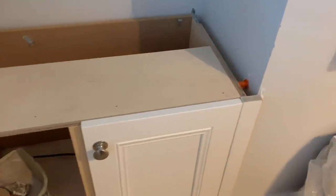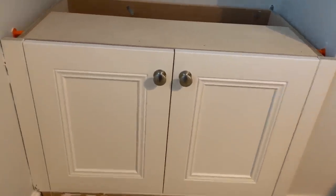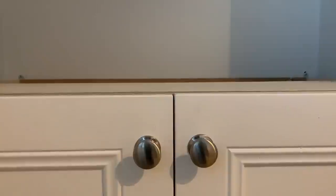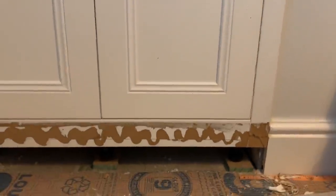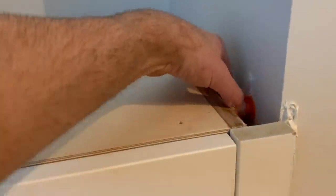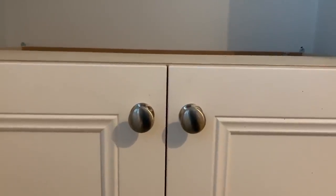I've got this one screwed back to the wall and I've just loose-fitted some space plugs there with gap-filling adhesive. I've gone ahead and popped those doors back on — bearing in mind they haven't been adjusted on their hinges since they were fitted before — and there's just a slight disparity which suggests the carcass is racked a little bit. So I'm going to loosen off this space plug and tighten this one until it's tipping those doors back to being in line and taking away the very slight taper at the bottom. That's done it — just getting that nice and tight has tipped that door back into line and everything's looking parallel.